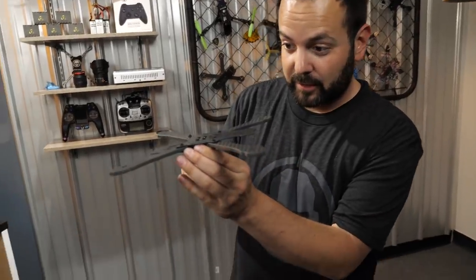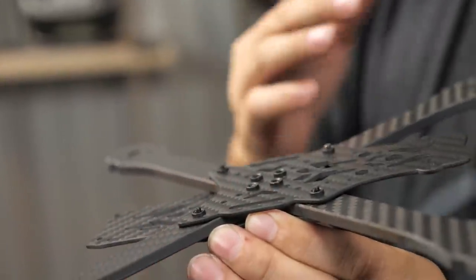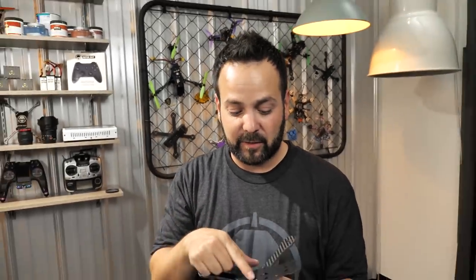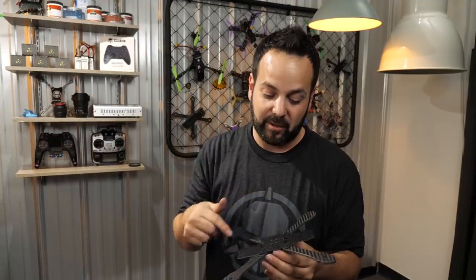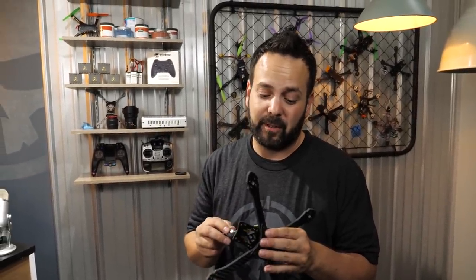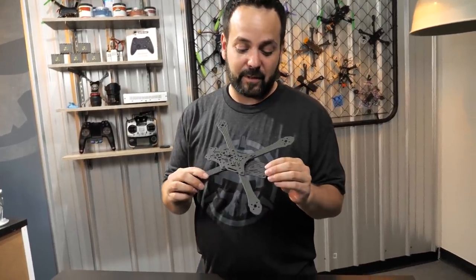The reason for the different screw lengths is that the inner screws protrude a little bit, and you don't want that under the flight controller. This frame is only going to be about that tall when done so you don't have much room to keep the flight controller above the frame. It's important to use the short screws at least for the center ones. If the protrusion bothers you, use the 10mm screws all the way around. An 11mm would have been perfect but that's a weird size and we didn't want to use a size people struggle to find.